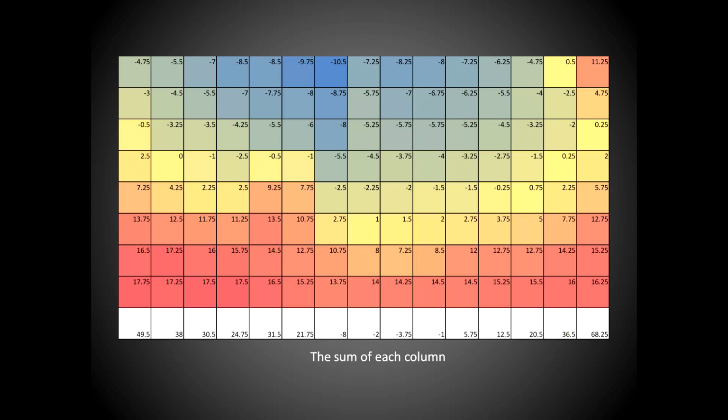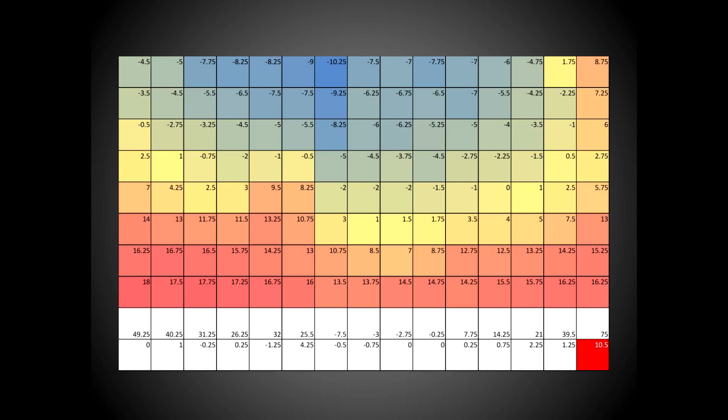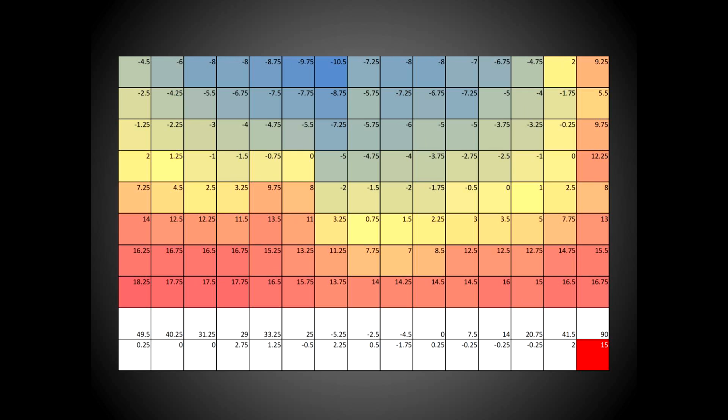I tried summing the rows of each column and using that value, and while it was much better, occasionally it would still look off to one side or the other. So I decided to compare the sum of the rows in each column to the sum of the last frame and calculating the change in that value between the current frame and the last frame. This worked well as the difference in change when a person walked into frame was large compared to the minor changes of things like tree branches waving in the wind.